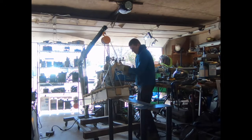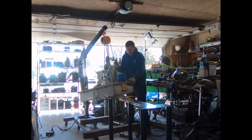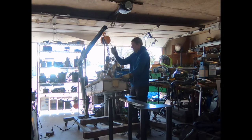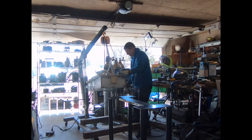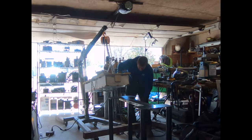One of the biggest things I learned in this casting is that you cannot go off the 24-hour curing schedule written in the instructions. Sometimes it takes longer than 24 hours before you can break those forms off — I've seen as long as a week.